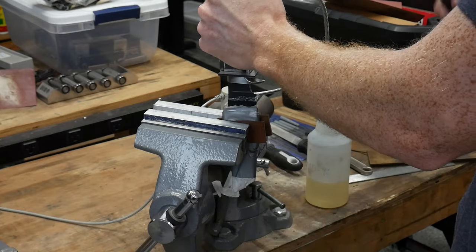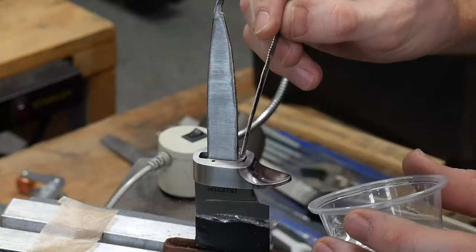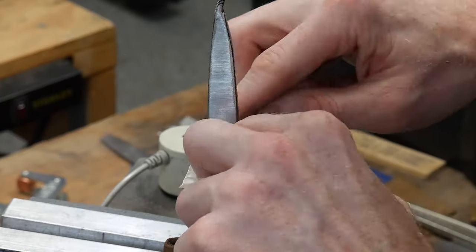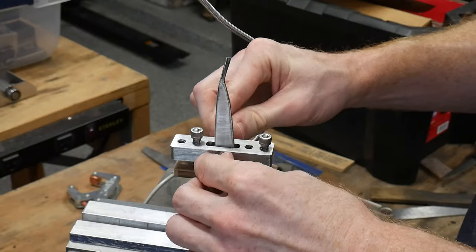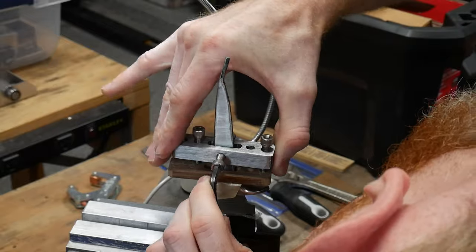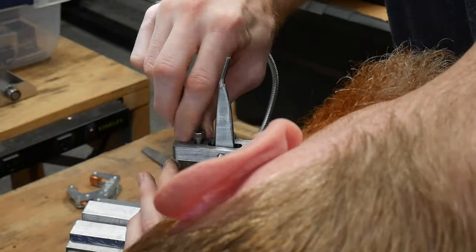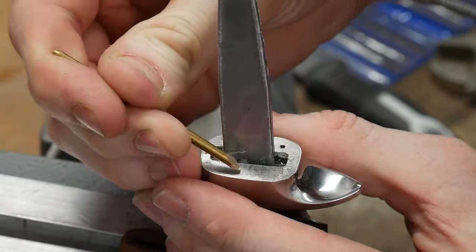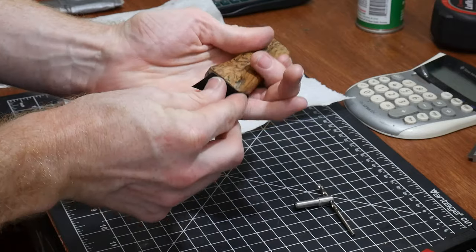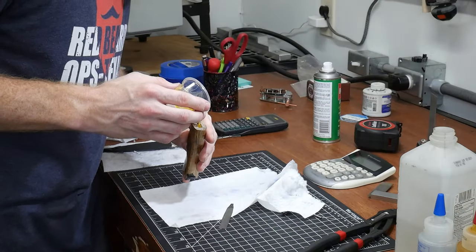At this point it's time for the final glue-up. I wrapped my blade in plastic wrap and tape, then hammered on my guard making sure it was square and the fit was still good. I mixed up some epoxy and drifted it into the guard recess before affixing my guard jack to the tang. This will hold the guard tight onto the shoulder while the epoxy dries. The epoxy is mainly for sealing the joint, but it also makes sure the guard doesn't move during the rest of assembly.